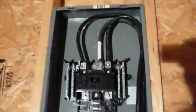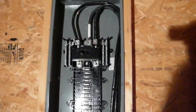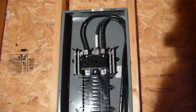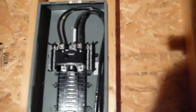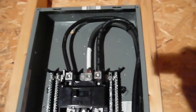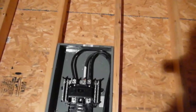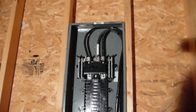Anyway, there's 200-amp service going to be coming in here. The city wasn't sure they could provide that, but the reasoning is maybe that's overkill — so too is a 40-position breaker box, but I've already got things found for about 20 of those breaker positions, and maybe more, because I'll probably end up adding more outlets than I've drawn out in my little schematic. I don't want there to be any question for a very long time that there is sufficient electrical power in this garage to do exactly what we want. We're definitely going to heat the floor, and maybe do something with forced air depending on how well the floor heating works.